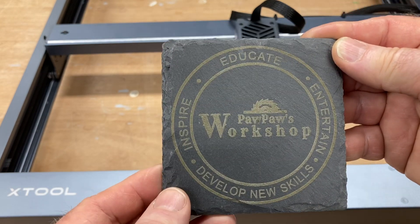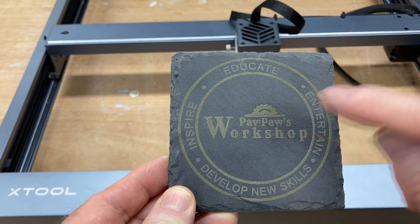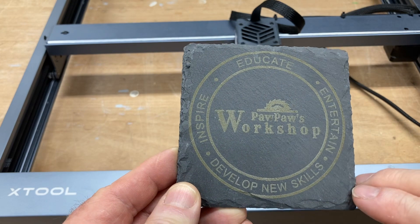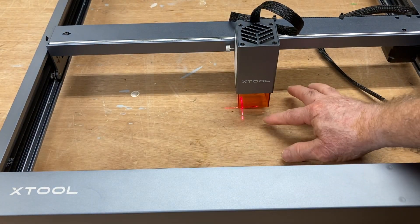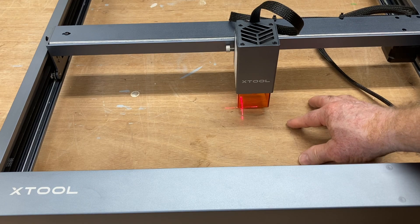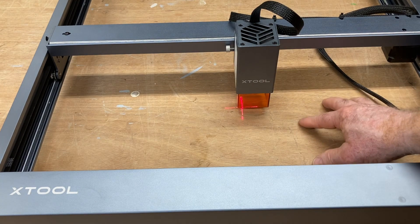I've shown you several ways to center it: one, using the crosshairs directly in the center; another way is to set up a tool path to mark the outline; and another method is to make a template using a waste board and have it permanently attached to the machine, so every time you set up and ran a job you can use that template on the waste board itself.